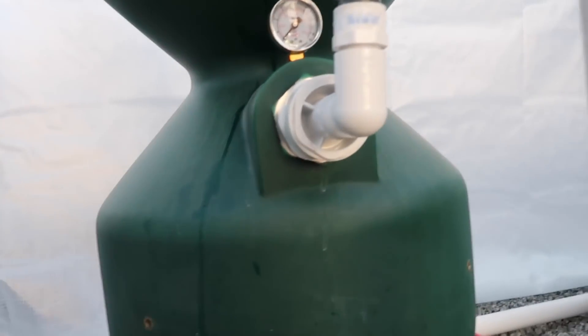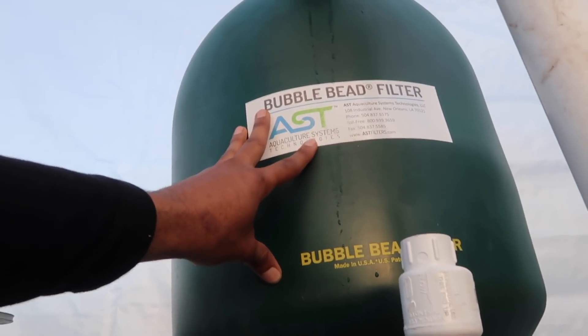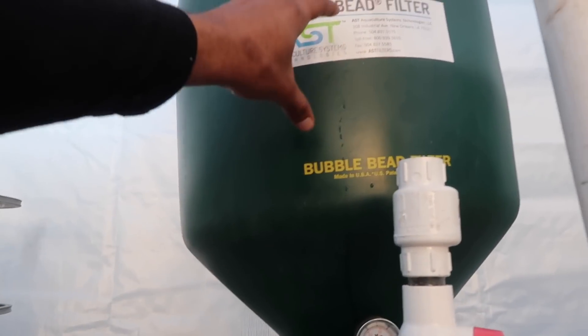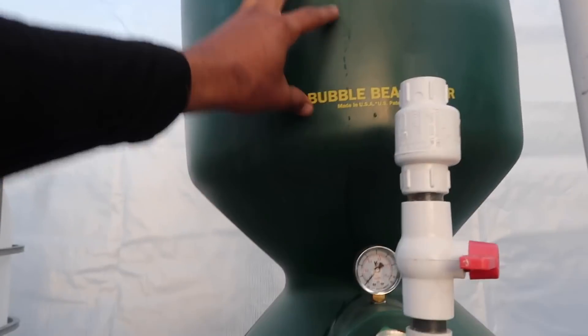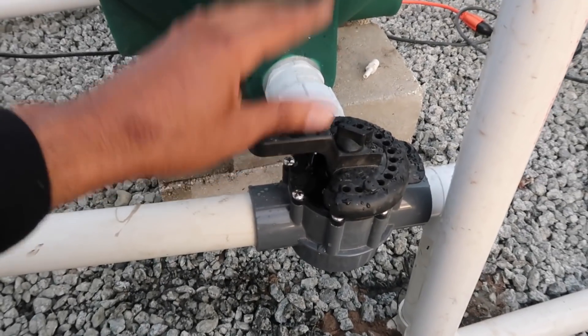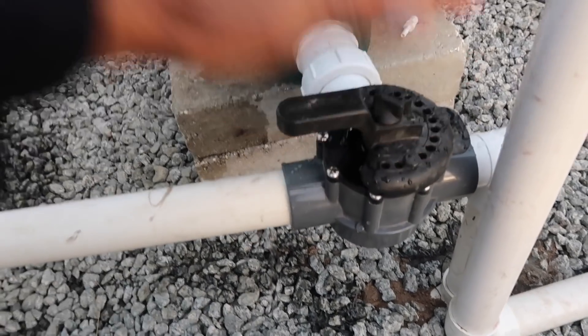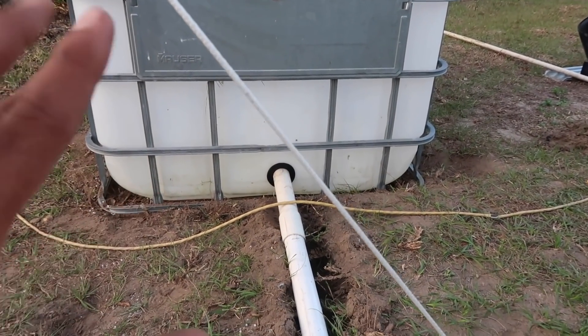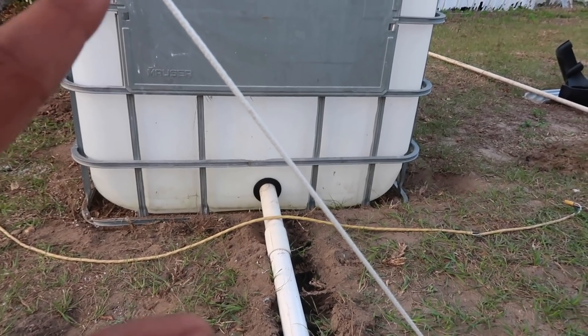I forgot to show you guys the mineralization tank — waste management. So once this filtration unit is filled up to its capacity, it needs to be backwashed. You need to be able to get rid of the solids that have accumulated in this filter. So what we do is use this unit here as a backwash — you just turn the valve and then the water will begin sucking down. Then it will exit out, come down here through an extra pipe that I built, and make its way down to the mineralization tank. That's where all the solids will be stored.